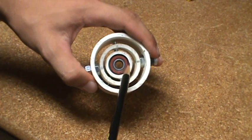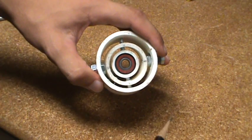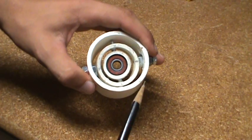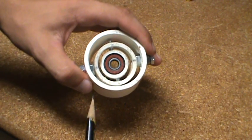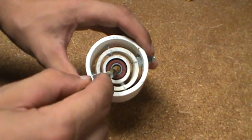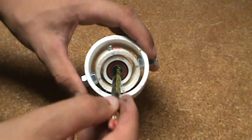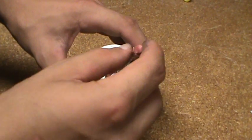To get that wheel bearing in there, you heat the PVC pipe up to 200 degrees. I used my toaster oven — put it on broil so it heated from the top — and then the bearing just slides right in there. It's a nice tight fit and stays together. As you can see, there's very little play in it; it barely wiggles around at all.